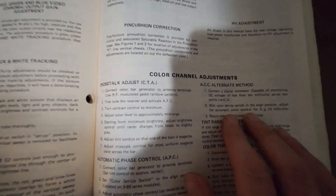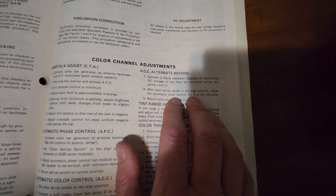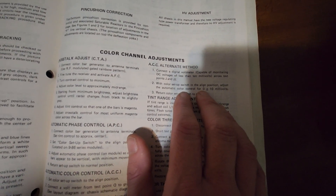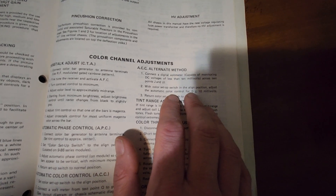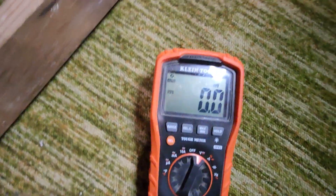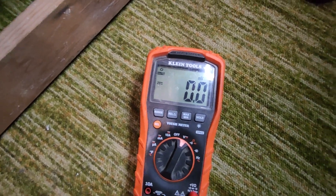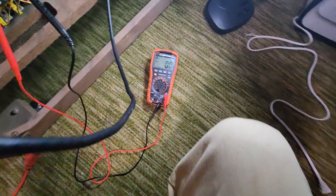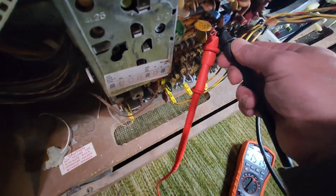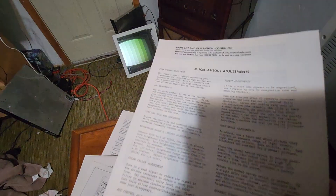Getting started, I wanted to try this on the color setup — the ACC alternate method. Looking up between J and JJ for zero millivolts within a range of plus or minus 10 millivolts. Man, you just can't ask to get that close more than once. Automatic color control — I try to do the grayscale every now and then. This picture is still flickering.